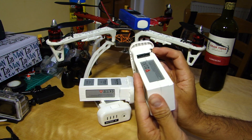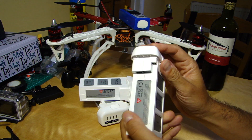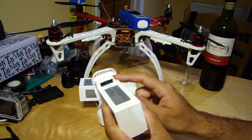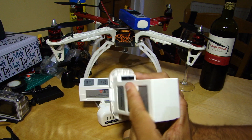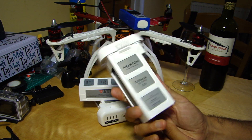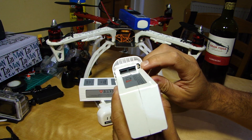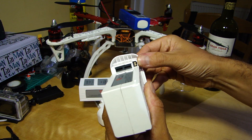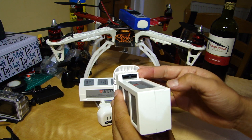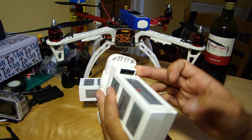The other thing this data can do is send a code. Each of these chips has a little circuit that generates a secret-squirrel type code which gets sent to the aircraft, and if that code isn't kosher then the aircraft won't let you take off — it comes up with an error that says 'invalid' or 'not a valid smart battery'. You can get that error if you've got dirt on these contacts or anything that's jammed in there and cuts off the signal. I did that to test it when I first got it — just basically not having those contacts make connection.